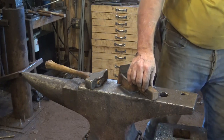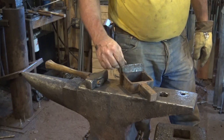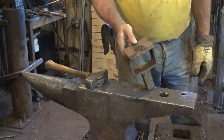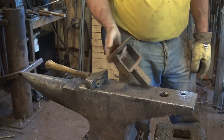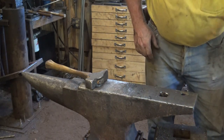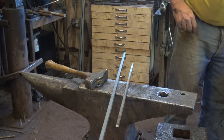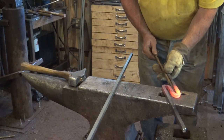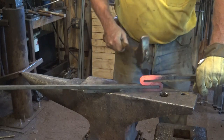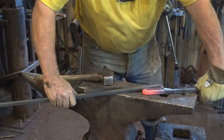An ideal way to deal with that is something called a bridge — you put this in there and just work on that side. This one is all fabricated, no forging done. It has a U-shaped piece of looks like five-sixteenths or three-eighths by inch-and-a-half that supports a piece of old grader blade just welded on there — it's been a pretty good tool. If you don't have one of those, we can use both spacers at the same time: put the three-eighths spacer in the side we're working on, line it up on the anvil, and if you've got a helper they can hold it.